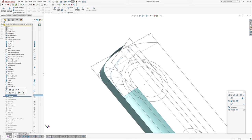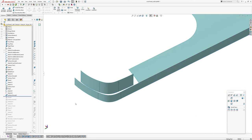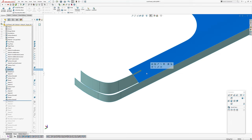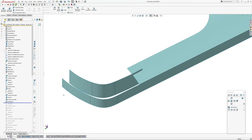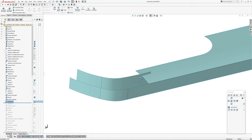Okay, so then I've extruded that centerpiece, and I've created a plane that runs from end to end, and just extended the surface to intersect with this surface, because I want to create an intersection curve there in a 3D sketch. I need to trim the top off this, but to trim it off I need to drive a spline curvature continuous to this intersection.